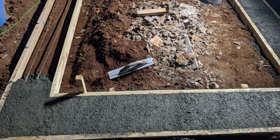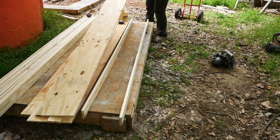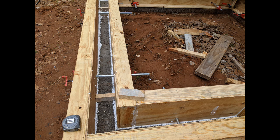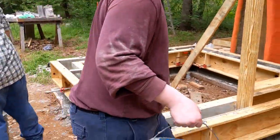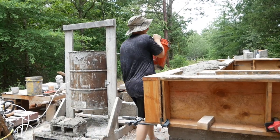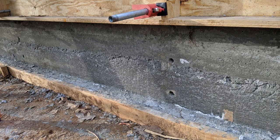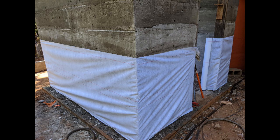The slip forms were built using sanded plywood and one-by-four boards, all glued together — an inside ring and an outside ring. We caulked the foundation so the aircrete doesn't leak on the first level, then mixed our aircrete, filled the forms to the top, and that's it for the day. Each day the slip form is moved up, reassembled, reclamped, more aircrete is mixed and filled in. As you get higher you can go ahead and apply the reinforcing fabric with the finished coats.